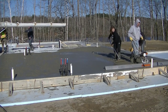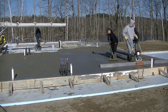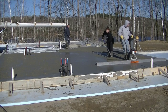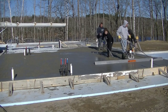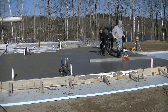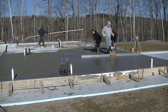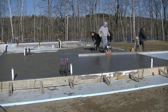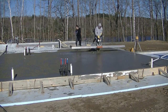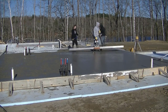It's probably one of the lightest Vibrascreeds I've ever used and it runs really smooth. You can see how easy it makes screeding the floor. All I'm doing is giving it about half throttle and watching my two ends, making sure they're touching. Tia, Darren, and Luke are just puddling the concrete behind me, making sure it's not too low and not too high. I just slowly walk backwards, steady and slowly without stopping, and it gives you a really nice flat screeded surface. It also makes the bull floating really easy — when you vibrate the surface like that, it gives you a lot of paste at the surface, so the bull floating is really fast.